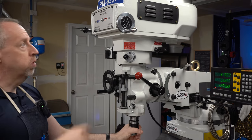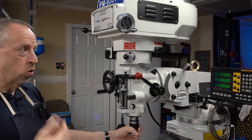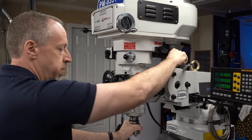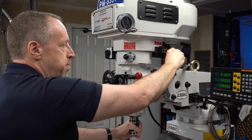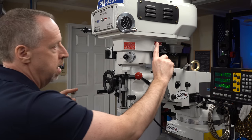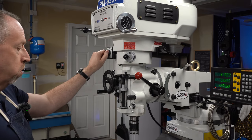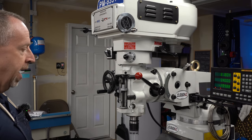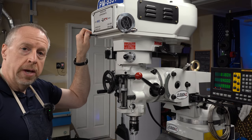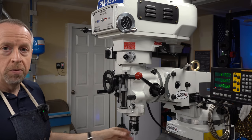This machine runs down to about 500 to 800 RPM. If you need to run slower for a larger tool or if you need more torque, this mill is equipped with a back gear. Press this knob in, rotate it around to the rearward position — you might need to grab the spindle and twist it to get the gears to engage. That puts it into back gear and gives you additional reduction, so this can run down to about 70 RPM. This gives you enormous torque, but remember that when you have it in back gear, it changes the direction of spindle rotation. So if I switch to forward, the spindle is actually turning backward — if you want to go forward in back gear, you have to select reverse. This always bites somebody — they put a big drill or end mill in and can't figure out why it's not cutting, because they're running the tool backwards and dulling it.